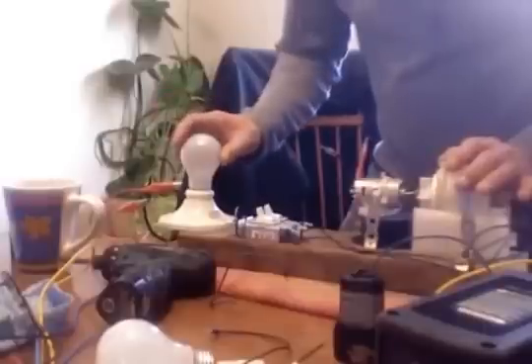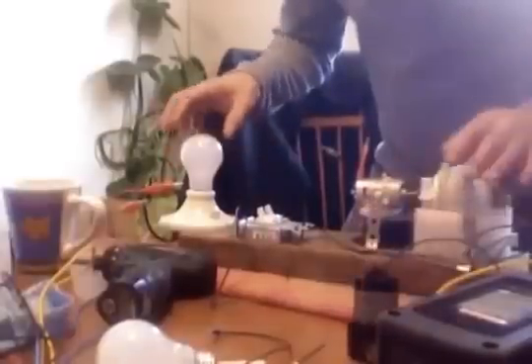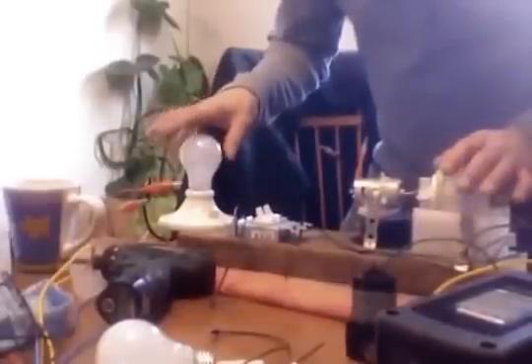It's no brain surgery — works a hundred percent. If I hook this 19 volt battery up to this thing, just run it straight to here, spin this up, this little induction motor puts out off the back end about 420 volts. Right now with the 12 volt it'll put out about 200-and-something volts. It seems like the higher the voltage input, the higher the output. If I run this at about 205 volts with a fully charged 12 volt battery, this bulb — when you do a test with your meter — seems like it draws about 20 or 30 volts, and it'll drop from say 205 down to 187 volts, and she's bright as hell.